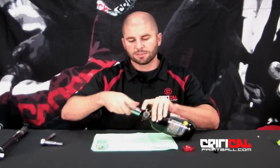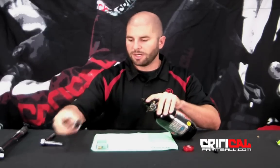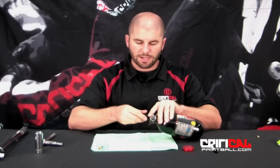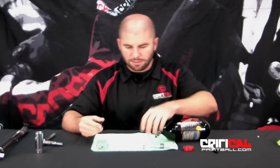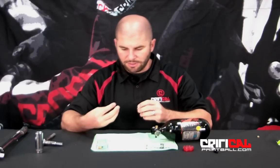I've already loosened this one up for the video. This is a .05 Allen key. We'll loosen up the safety set screws and then use a 7/8 inch wrench to unscrew the bonnet. So we'll get that off here. Now we've got the spring aside, pull the piston out, and you've got your pin valve there.